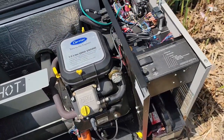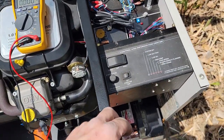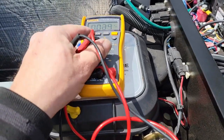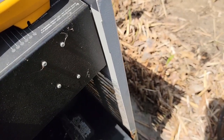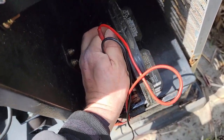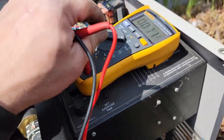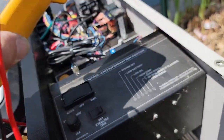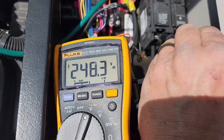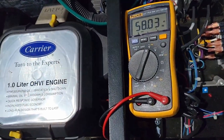Same thing with the voltage regulator - this thing is known for failing like crazy. If you've got super high voltage, like 330 volts coming out, chances are that thing's fried. Here's your battery charge circuit. What we're going to do now is test the voltage and frequency. I grabbed my Fluke 117 meter - it's good enough for generators, nothing too complex. Let's check our DC voltage to see what our battery is coming in at for charging state. We've got 13.6 volts - a little aggressive. Now let's go to AC voltage.